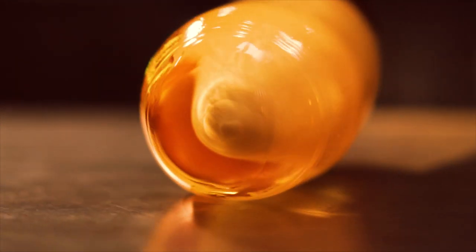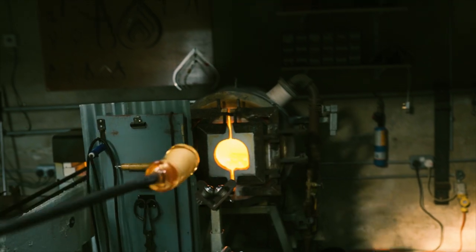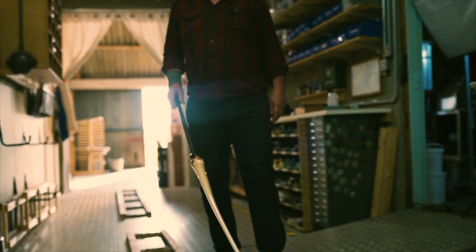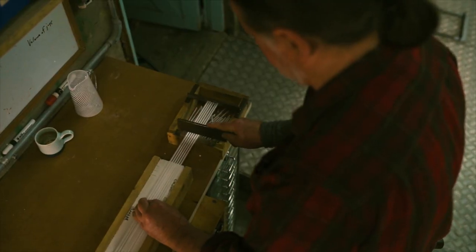All the shaping, all the decoration, everything made to a specific shape or height or diameter was done in this temperature range for the glasses. It's actually still moving — it's still a plastic material. So it can be affected by how you move with it, by gravity, as well as time and heat.